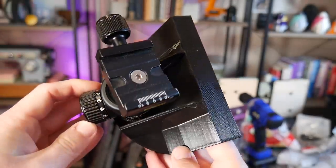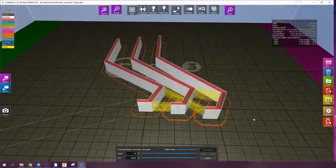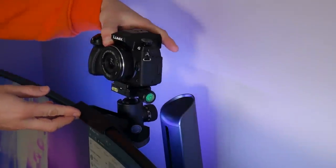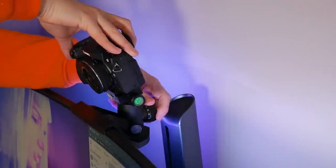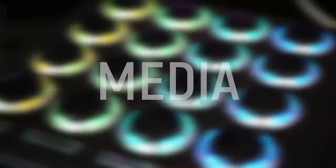The monitor is gigantic with a lot of mass and rigidity, so I designed a ball joint with a quick-swap plate in Fusion 360 that attaches to the camera and sits on the edge of the monitor. Since it's a curved monitor with weird angles, I printed three test angles, picked the best one, and used it to make the final part. This approach saved filament and time. Now I can record tutorials and streams at 1080p with a proper micro four-thirds lens — fantastic.